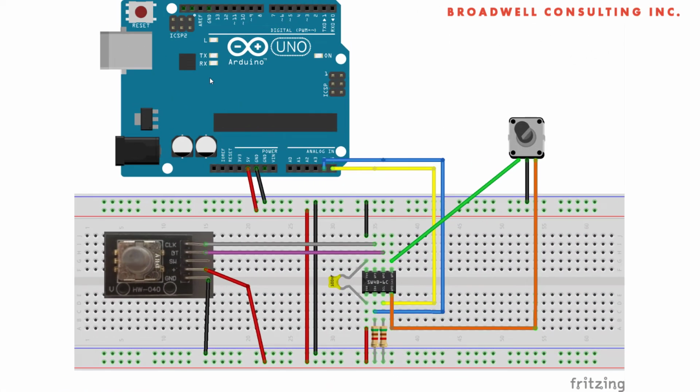Let's take a look now at our Arduino demo sketch. We're going to use the circuit that you see here. We'll have a Serial Wombat 4B at I2C address 6C, connected via I2C to our Arduino, and we're going to use 2 of the Quadrature Encoders that we saw in the earlier part of this video. The first one doesn't have pull-up resistors, the second one does. We are not using the one that has the capacitive filter, so we want to see that we can make this thing work without those capacitors.